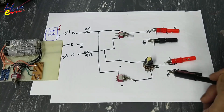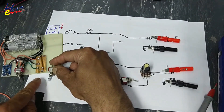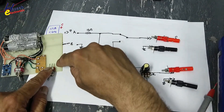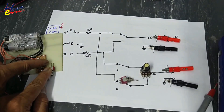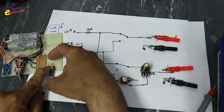From minus 3.7 to plus 3.7 volts. With the switch in one side I will take the negative out from that side, so the negative must be connected here. We will take the output from the center point, and the left side pin will be connected to positive, so when we move the switch to that side, positive will come out.